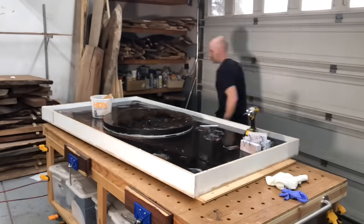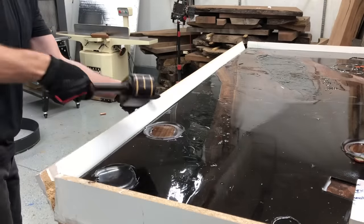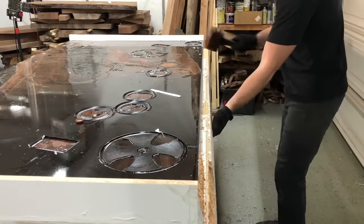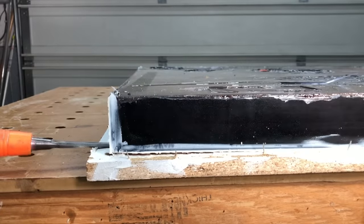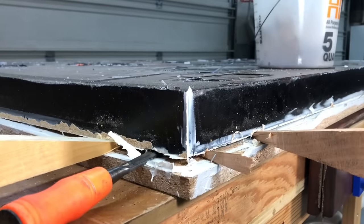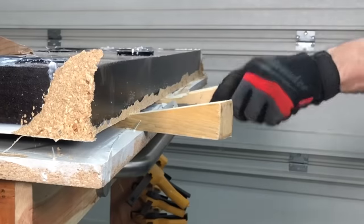Now I'm going to demold it. If you didn't watch the how-to-build-an-epoxy-table-mold video in the description, make sure you use mold release on these. Don't just use melamine — you can also use tuck tape or Tyvek tape, but make sure you have some sort of release agent. Otherwise this melamine will essentially be impossible to get off. I just have a handful of wooden wedges I made from two-by-fours, work my way around the perimeter, and then it just pops off. The whole bottom is actually quite smooth and slick from that mold release.